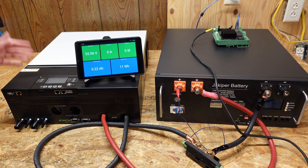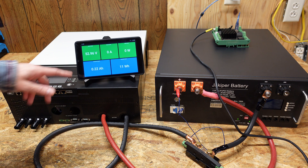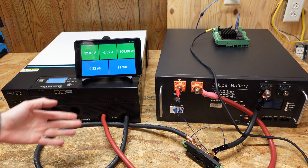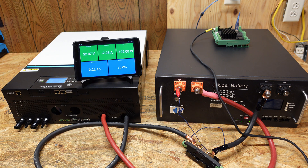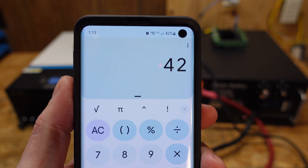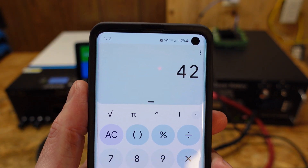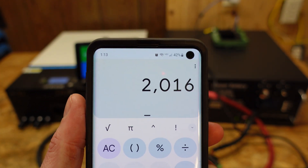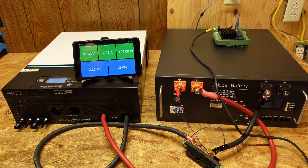Now with the new LV6548V hooked up in the same setup and powered on — 109 watts for one inverter. That is unacceptable. I figured it was going to be maybe five or ten watts more. At 108 watts, that's a difference of 42 watts for one inverter. Most people will use two in a split phase configuration, so that's 84 watts of extra idle consumption times 24 hours — roughly 2 kilowatt hours per day extra just to have the additional 120–130 volts of PV input headroom. That is a complete deal breaker to me.